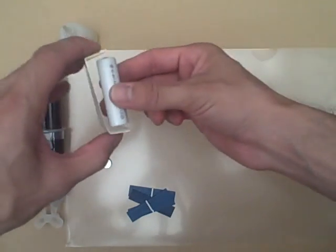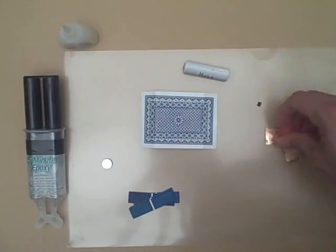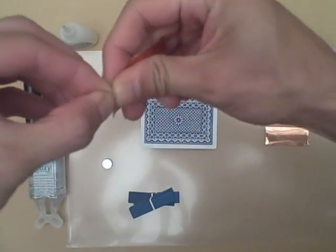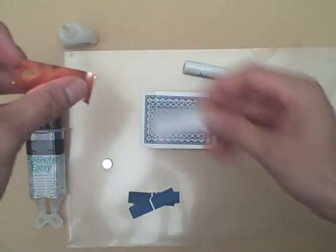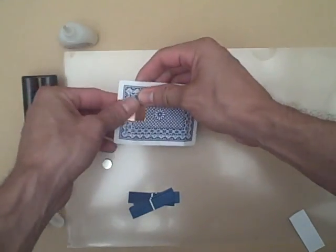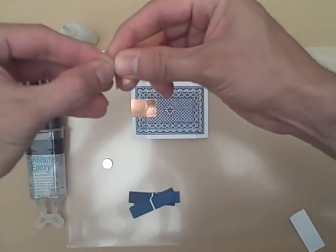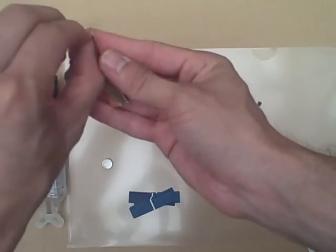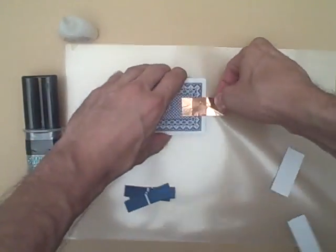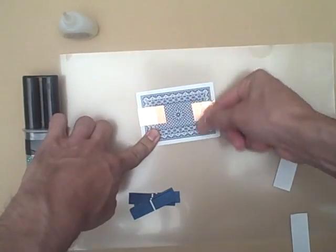You'll need an AA rechargeable battery. Then we're going to put on a few pieces of copper tape. It's widely available and cheap, and it's got adhesive backing. It's really only conductive very well along the shiny surface on the top, not through the thickness. I'm going to put on a couple pieces of this, and these are going to form the connections between the string of solettes — or small pieces of solar — and my battery.